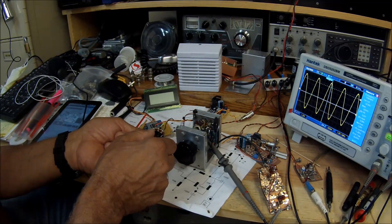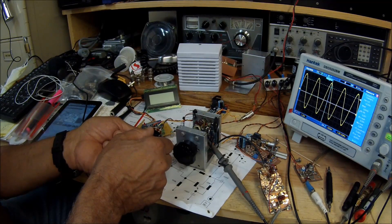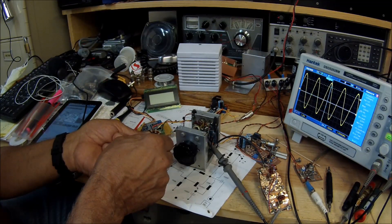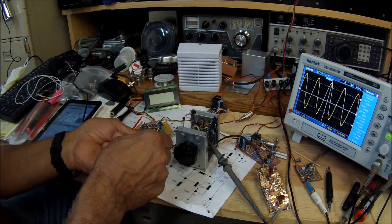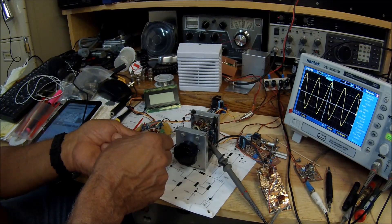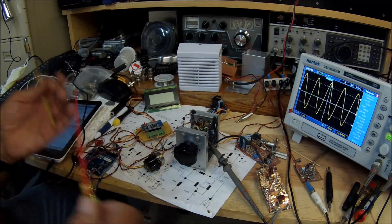So that is four diodes, a couple of ferrite transformers, an audio amplifier stage. This happens to be a MOSFET VFO that is normally tuned with a variable capacitor, and I am tuning it with a varactor tuner to slow down the tuning rate. We also have, from the antenna — which is a 20-meter extended double Zepp peaked on 40 meters — a single stage of RF amplification, which is right here.